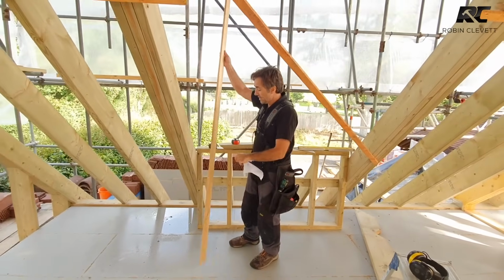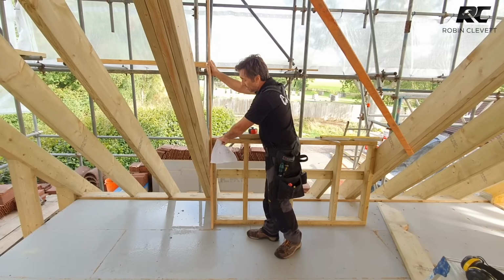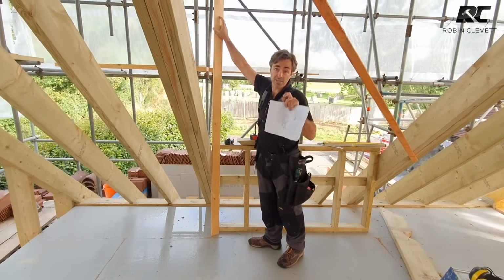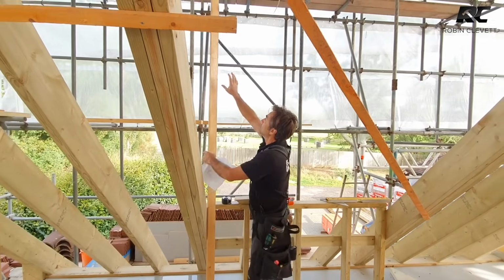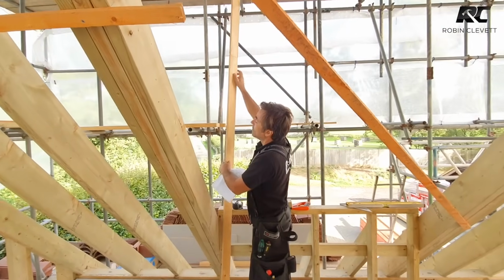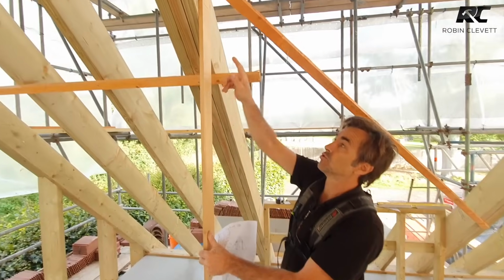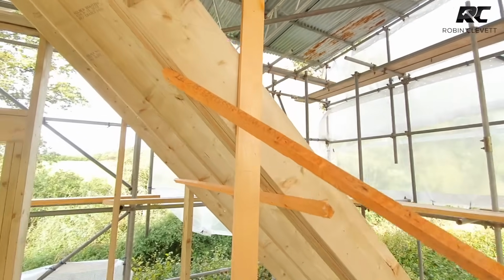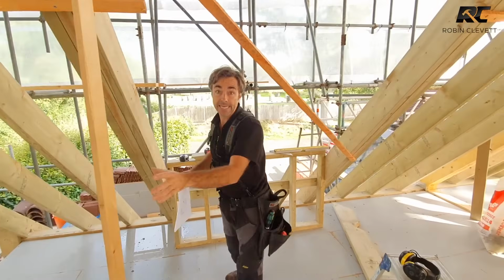So my rod is showing everything that's important to me, the sill height. I've got an allowance for my lead. I've got my window head height, including a little bit of an allowance for fitting. Then I've got my head beam, which is running across above the window. And then I've got my plate height. So that enables me then to come round to where the dormer or the wall plate will intersect on the side cheeks. And it gives me an idea of how long everything needs to be for me to put together